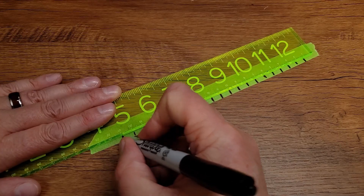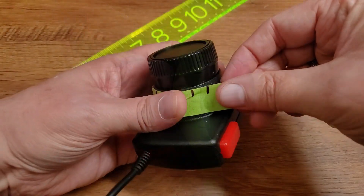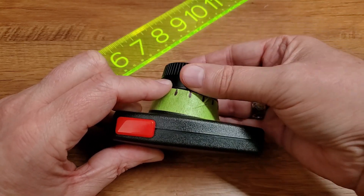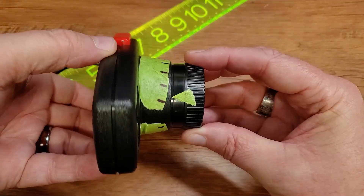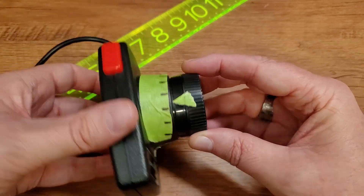I don't have any potentiometer tools, so I came up with what I think is a creative way to get it done. I took some painters tape and put a mark at every one centimeter interval all the way down the tape. I then wrapped that tape around the circumference of the AT Games paddle controller, and finally put a small arrow on top of the paddle. Now I have an arrow that indicates when I've rotated the paddle one centimeter in radial distance. A paddle is typically about 330 degrees, and I have 15 hash marks around the paddle, so every centimeter equals about 22 degrees of rotation.